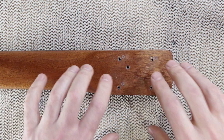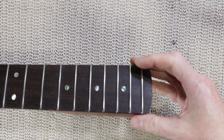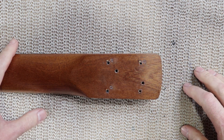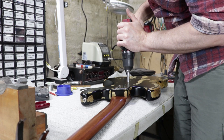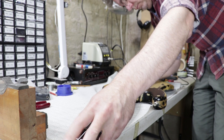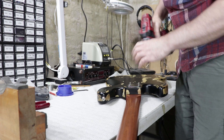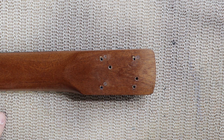It's important because with this neck the truss rod adjustment is in the heel, and the body doesn't have a routed recess for an allen key. I don't really mind removing the neck to adjust the truss rod - my old 70s Fender P is like that. Normally you remove the front two screws completely and slacken the rear ones by maybe a quarter turn, tilt the neck enough to get your adjuster in, make your adjustment, and put the neck back down. But every time you return a screw into the same hole you risk the screw not following the original thread and cutting a new thread on top of the old one.